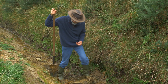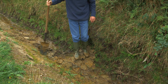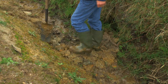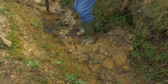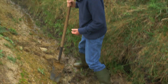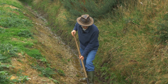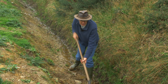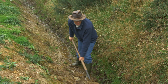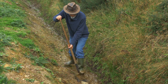I build this up in layers and just dance up and down on it every so often to really puddle it in well. What I'm trying to do here is to create a nice, solid, impermeable dam out of the clay — and we're lucky here because we've got good heavy marly clay, good heavy stable stuff. I'm just working back up along and adding to the dam with every shovel full, and by the time I'm finished the plan will be to have a good impermeable dam.